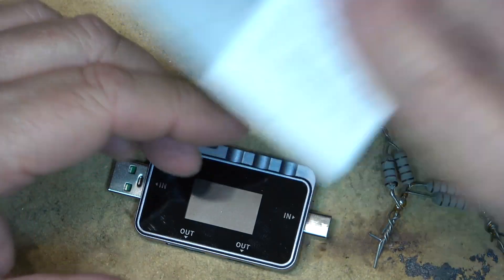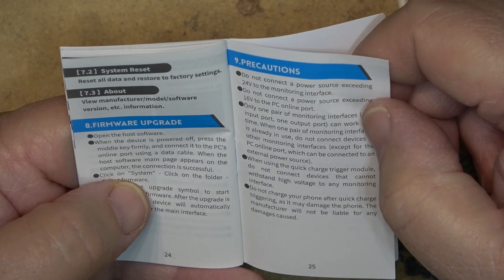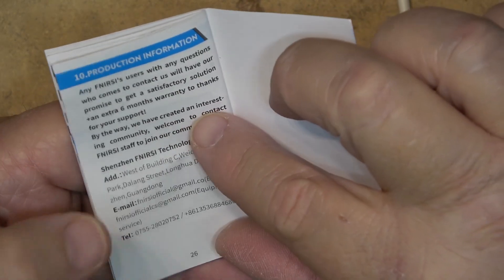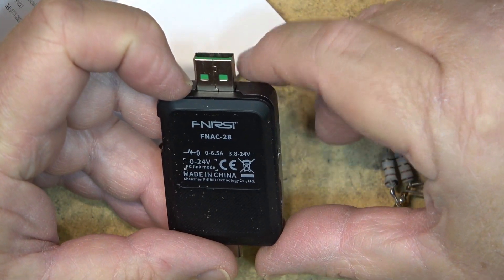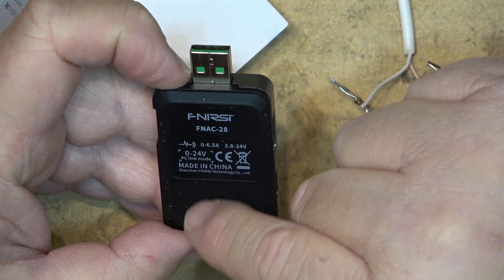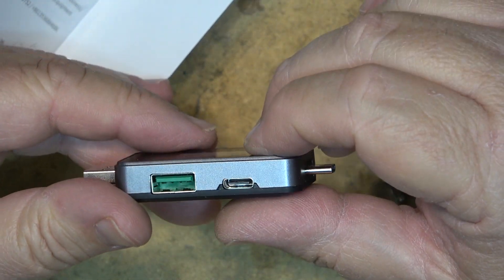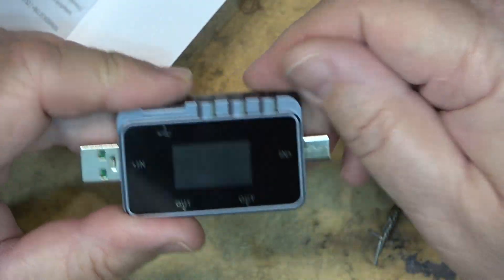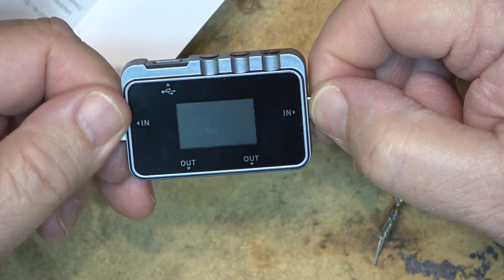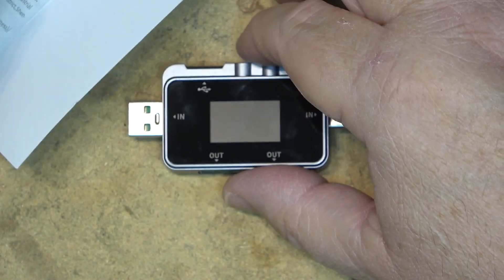That pretty much does it for this little meter. It certainly gives you all the readings you could ever want to know about USB and USB-C. It lets you select protocols and can update the firmware as well. On the back, the specifications show it will measure between 0 and 6.5 amps, and 3.8 to 24 volts, with a PC link mode of 0 to 24 volts. I'm going to put a link in the description — it came from Banggood. It's a neat little device, and I think something a lot of people will find useful when prototyping or testing anything that deals with USB power. Something like this could be invaluable for showing you what's going on between USB and the device. Thanks for watching — we'll catch you in the next one.